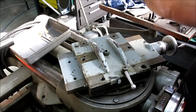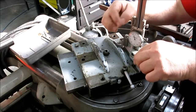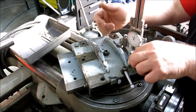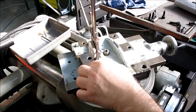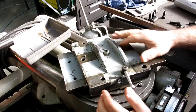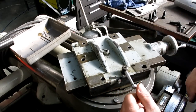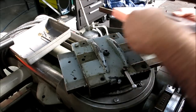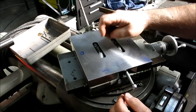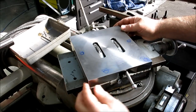I just want to show you guys there's a little difference between them. This is pattern maker stuff, this is a casting. You wouldn't expect these to be exact, but I thought I allowed plenty of extra. Anyway, this one's considerably higher. I discovered it when I went to test fit the plate - it was rubbing here, then I milled a little out of the bottom and set it down, and then this one was rubbing. So what I did was I decided to blow the pockets through, because it was so thin here it sounded like tissue paper. You could tap on it and it made a funny noise. So I said screw it, I'm just going to pop through.